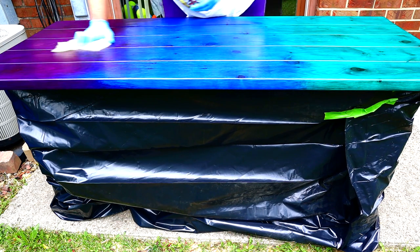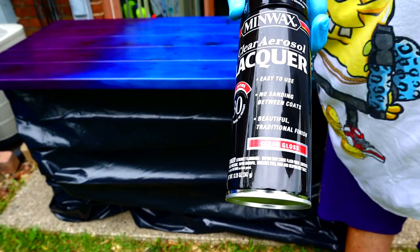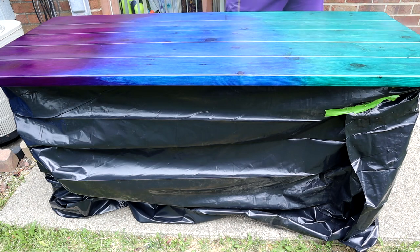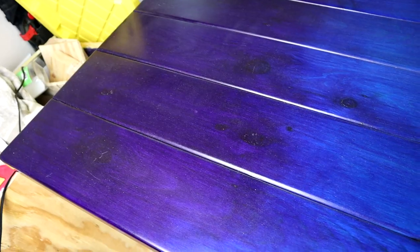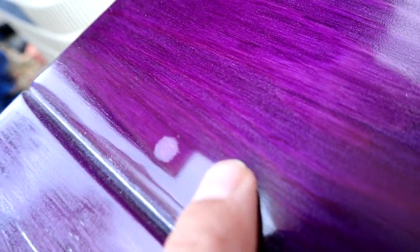I'm wiping it off with a tack cloth. Now this right here — do not buy this spray lacquer, this was the worst idea I've ever had. I sprayed over two cans and put about ten-plus coats on there and it still didn't work at all. No orange peel — this was concrete peel; it felt like rubbing my finger on concrete, it was horrible. When I tried to wet-sand it, it went right through the lacquer — that's what happened. There was even a drip from the can that ruined it. Painting in the sun didn't help either. So I had to start over.